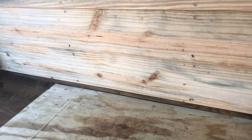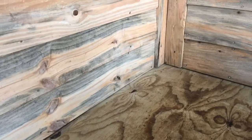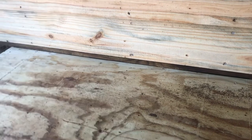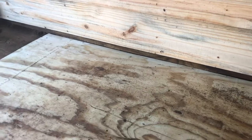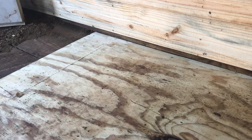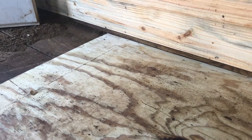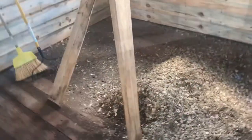Now you can see how bad the bow is in the floor - that makes it really obvious. That bottom row of siding is level, and you can see how much of a gap there is underneath where it's flush at the corner. The whole foundation of this barn did that - you could see that the floor had sagged in the middle even before we put up the first wall. My fault for not building a real foundation; I just put it up on piers and those probably sunk in the mud. Anyway, first part of the floor is down, so now I'm going to shovel all this onto it and clean out the rest, then get the next two pieces down.